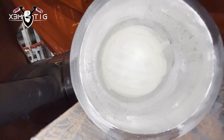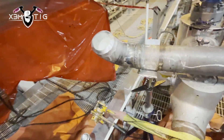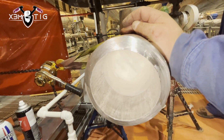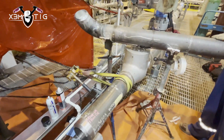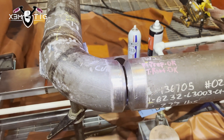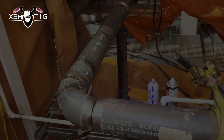This dam is specifically designed for the needle purge - there's a related continuation video you can check out once it's done. It's a four-inch pipe with lots of work involved, especially in the field. Sometimes bigger pipe is actually easier to work on. Now you can fit it in place - you've already checked it, the gap is set, put your tacks in and cover with aluminum tape. That's it, ready to roll. Hope you guys liked it and learned something - see you in the next one, take care.